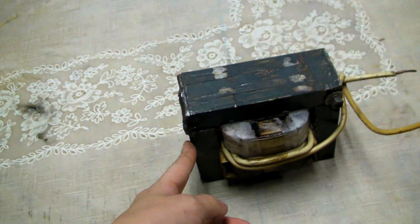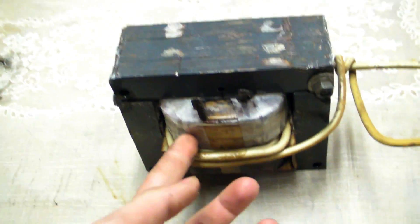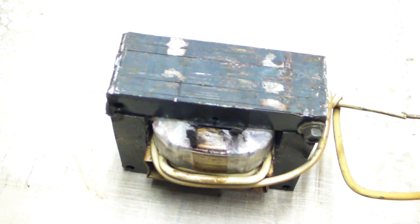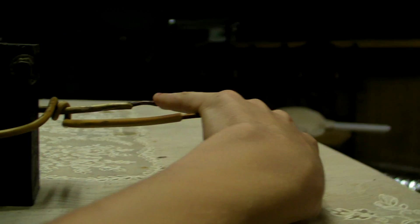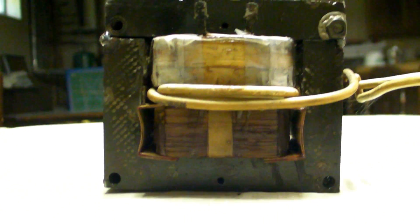This one is the one I repaired from my quad, which is now only dual. It arced over from the primary to the core. I got the die grinder, cut it all open, pulled out the primary, found out where it was arcing over, taped around it, insulated it, and popped it back in. During the process I removed the shunts and replaced them with two windings of 8-gauge wire for high current — I can get some nice little sparks out of there with a screwdriver. It doesn't interfere like a shunt would, so it's still technically de-shunted.